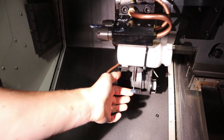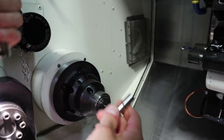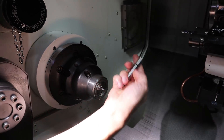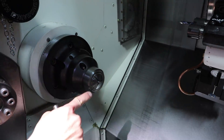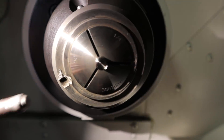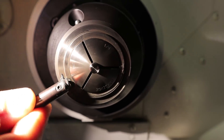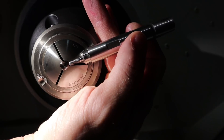I have another Accu Hold in the machine right now — currently it has a deburring brush in it, and that's how it looks in the turret. Even with the set screws on the side, we were worried about runout, but it's got like just a tenth of runout, which is nothing, so it has worked really well. The tool has to extend quite a bit out of the tool holder to get past the collet, otherwise your big ER25 nut is going to crash into it — and that actually happened a couple months ago when Rob Lockwood was visiting, because I had an offset wrong.